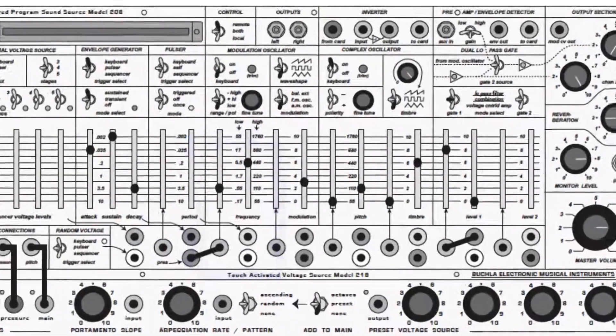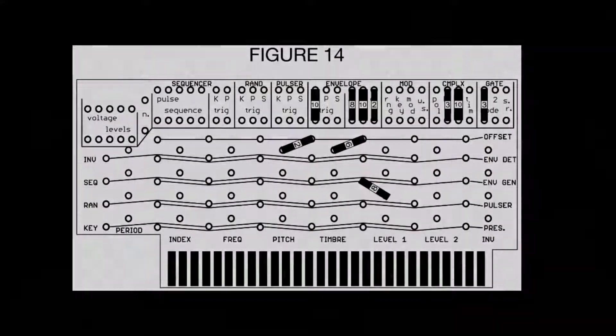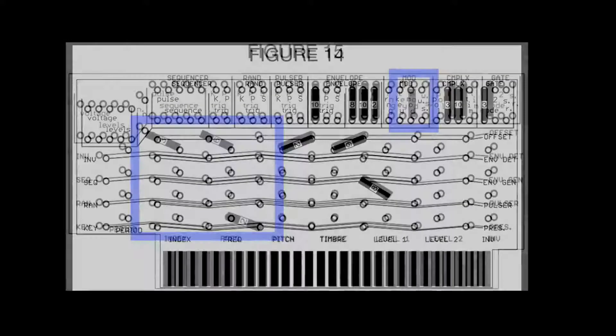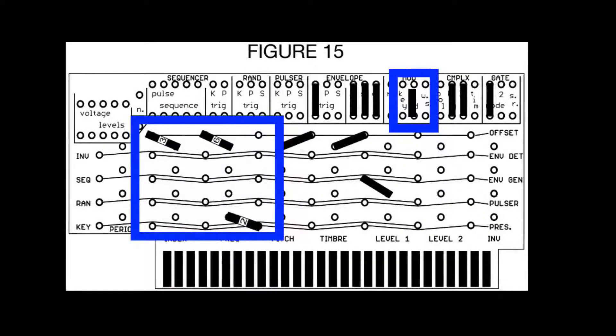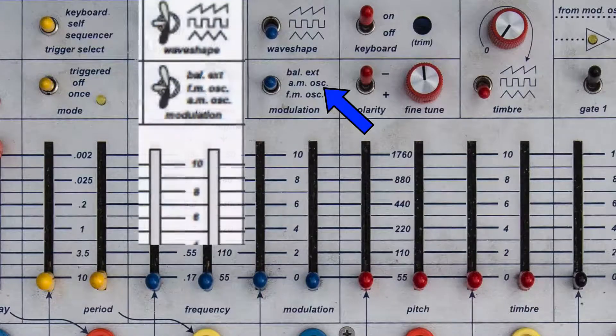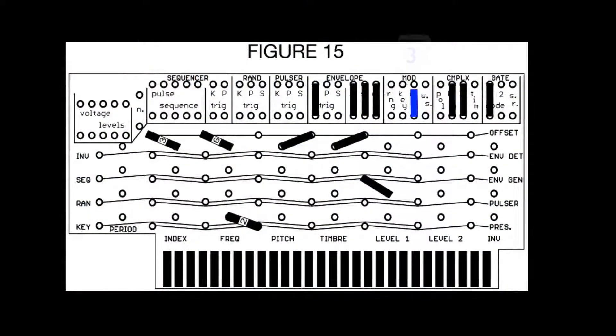Here are the faceplate settings. Likewise, the program card builds upon the last one by adding four resistors to mimic and save the new patch. There is sort of a misprint here, since the final faceplate and function of the new Easel has amplitude modulation in the middle slot of the switch and just needs a conductance value resistor of 3 in that place for AM.